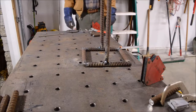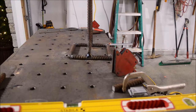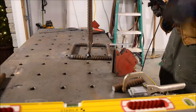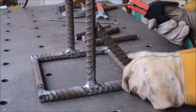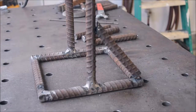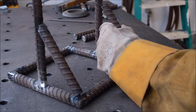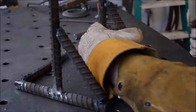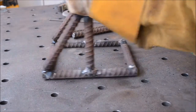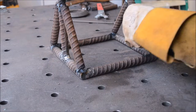I just test fit the top piece up there to see how it looks. It's a pretty basic project. The longest part for me was probably doing all the cutting of the rebar, and I ended up using a piece of old lawn mower blade for the actual blade of the cracker. These little support pieces — about 4 or 5 inches — give those long 24-inch legs a little more rigidity, because this thing is going to take a pounding. You set the log in and beat on it with a mini sledgehammer, so I definitely wanted to make sure it was stout.